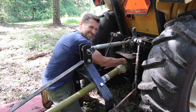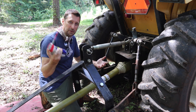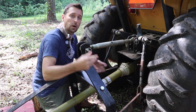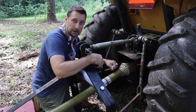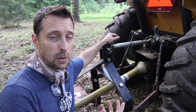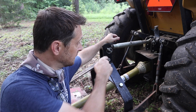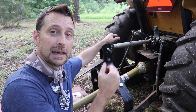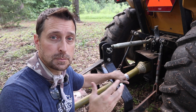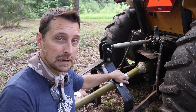I've yanked on this and yanked on it and it is just not going anywhere. So what we need to do first is give it a little lubricant. You always want to lube it up — make sure everything is lubricated properly when you put your drive shaft on your PTO spindle anyway. Last week when I put the brush hog on for the first time this season it was very difficult to get the shaft on the spindle. I cleaned it the best I possibly could — took a wire brush and some carb cleaner, scraped off the inside of the hub and the outside of the spindle, and it was still extremely difficult. So make sure everything is perfectly cleaned and lubricated, but that still might not be enough. You need a little help sometimes.